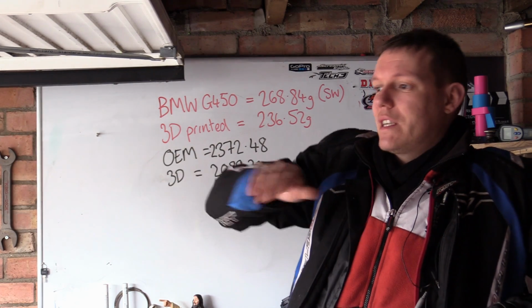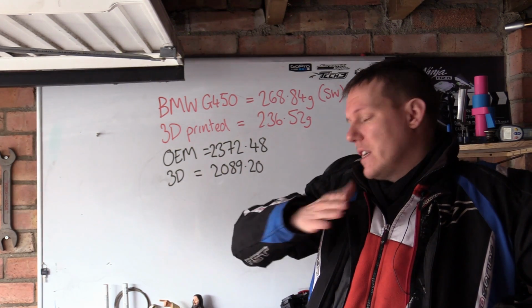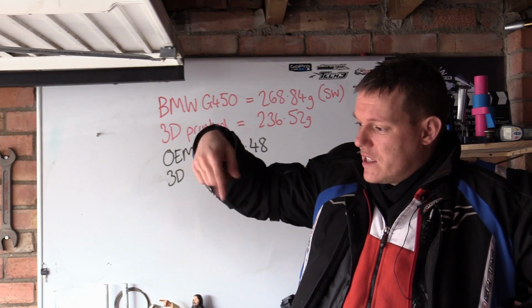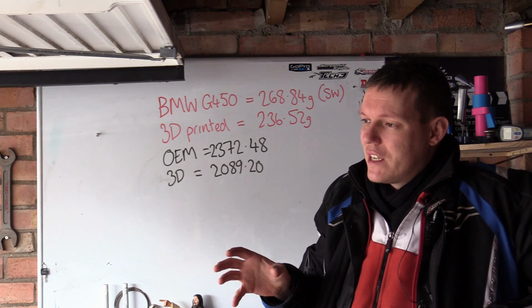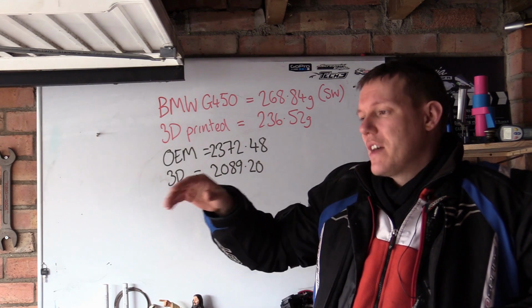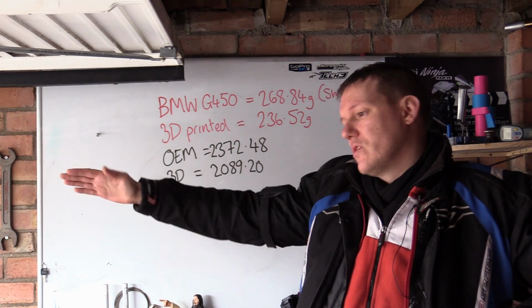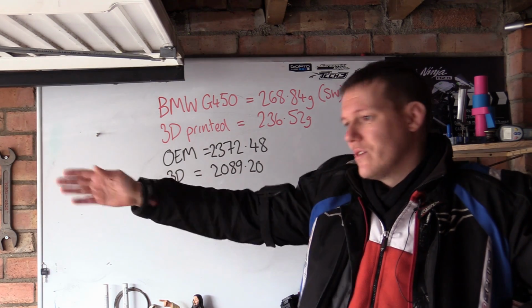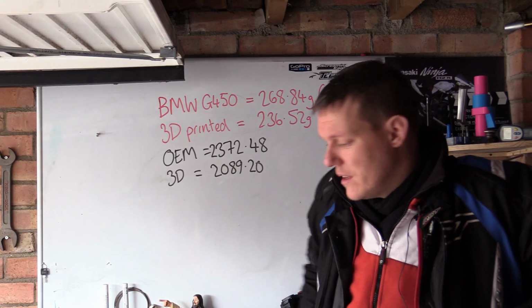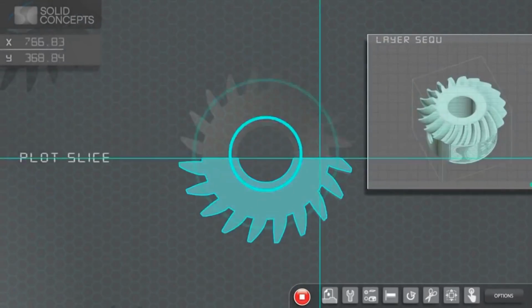The way it works is that you lay down a nice thin bed of the stuff, and then a sintering laser comes in and heats everything up, so basically the crystals start to form together. Then a roller comes in and lays another layer on, and then it lasers it, and it does this, and it lasers it. Here's a video. The DMLS equipment.